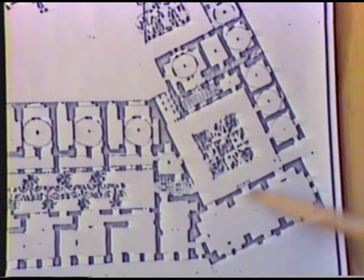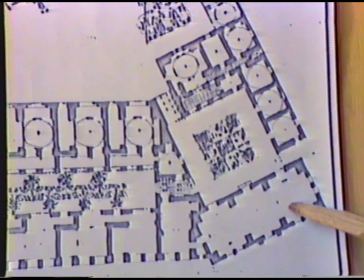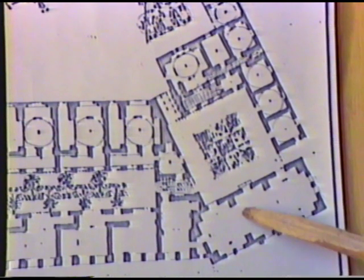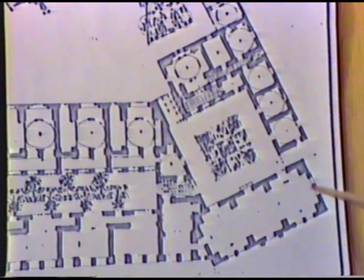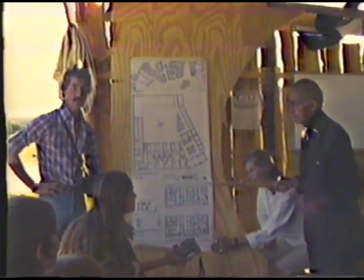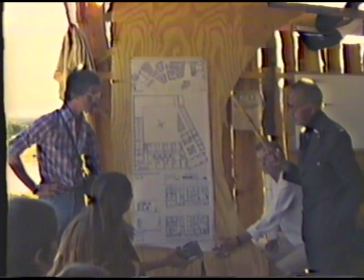And it had to be large, because if the class were to have 30 or 40 boys, this would have to hold more, 100, let us say. So it was subdivided by arches here and domes here. That way, we have a great variety of combinations. You can solve the problem by combinations between vault, dome, and arch, and so on. Like we have made a combination between the vault and dome to roof the bedroom.